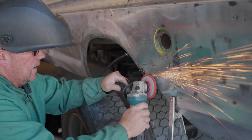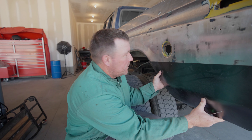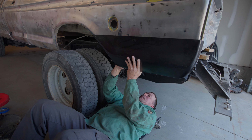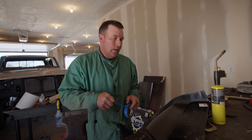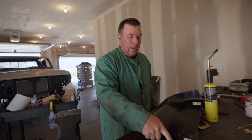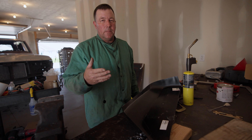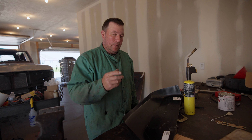I'm going to put this up in here where it needs to go, mark the inside bigger than what it actually needs to be. I'll tape a mark so I can cut it straight, just like I did on the body. I'm going to do a half-inch overlap, and the reason is I'm literally going to overlap it but then cut in between the two pieces of metal so they line up perfectly - instead of trying to cut it out and make it fit, which always has gaps. This way you just set it on there, cut between the two metals, and make them line up.